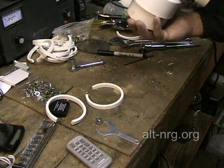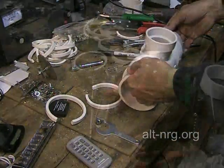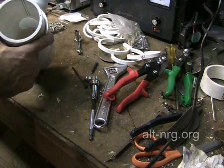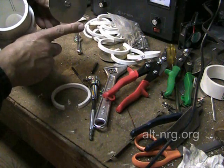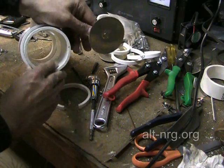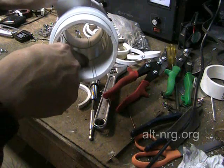The other thing to remember is that the plates will have a vertical orientation for the gas outlet and the electrolyte flow underneath. I have decided to create the channels underneath and on top of the circular disc plates rather than modifying the plates too much. What I am going to do is, on the top and bottom of each plate, just create a flat area — flatten it out slightly so that the gap is a little bit larger than flush with the inside edge of the tube. That way, when I apply the adhesive it will go around the bay underneath. The actual channel is going to be cut into the PVC plastic on the inside with my Dremel tool.